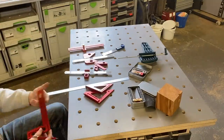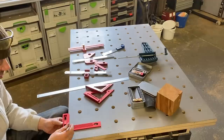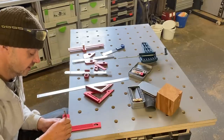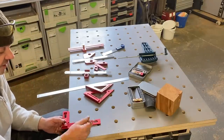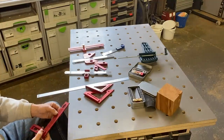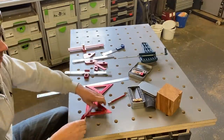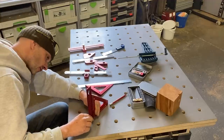Last one in the marking tools - we've got this, which is like a T-square. You can do your normal T-square stuff. There's also a spot here to put a felt tip if you want to run it along for big markings, and a spot right on the end there to mark right on the edge line. Then you've got all your divisions - put your small pencil in and that's there. Anyway, that's really good and really accurate again. Everything's perfect - there's no light through anywhere.